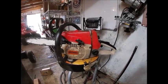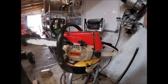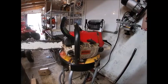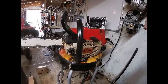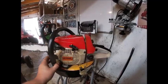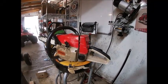Dad said he had some small trees in the way up where he's doing some bush hogging on his place, so we're going to take this saw and put a little bit of time on it. The test cuts are about all it's been through, along with a few heat cycles. I do three or four heat cycles here in the shop — idle, warm up, cut off — then I dial the saw in on a piece of wood, take it to the woods, and work it. It's either a go-or-blow deal, and nine times out of ten it's been successful. With that said, you guys stay safe out there and y'all have a good one.